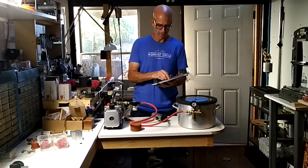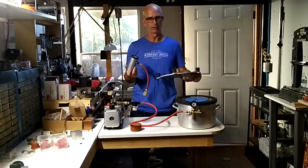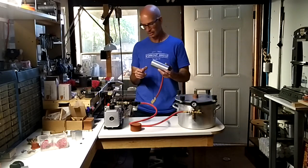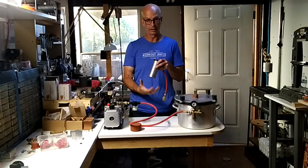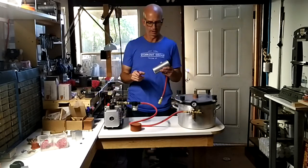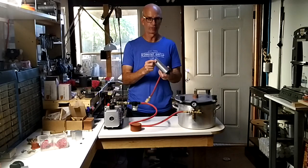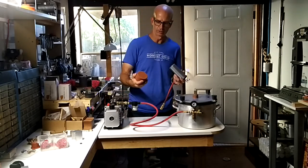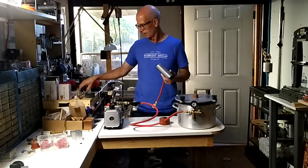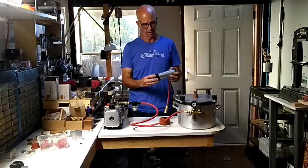I thought we need something that will catch the investment and mostly catch the molten metal. I kept thinking what could I use on the bottom that the molten metal could land in and not contaminate the metal — and also let the metal cool without hurting anything. So I came up with using my red clay for sand casting. This is a really fine clay and it gets put through here; you only need about a half inch.